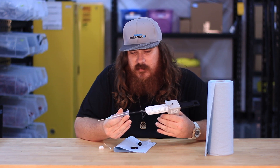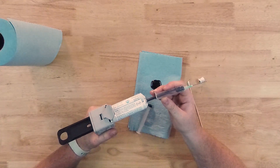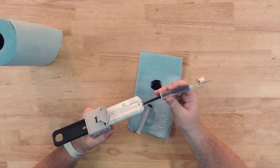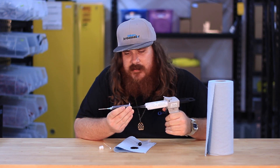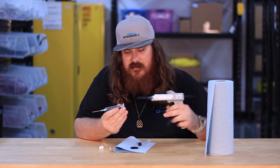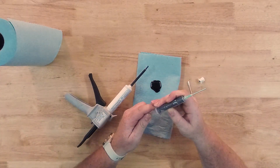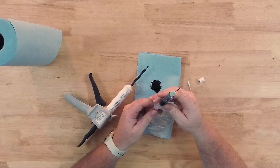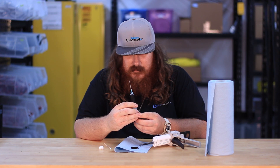Once you've purged, we're ready to fill our syringe. I hold it horizontally and allow an air channel to form on the top, and what that does is when you put your stopper in you should just be able to push all of the air right out of there, and the syringe should have just epoxy with no bubbles. That's what you want.